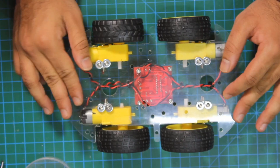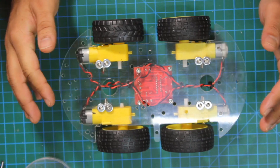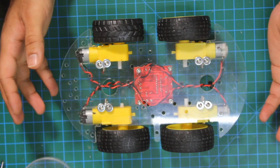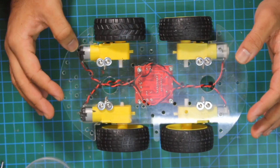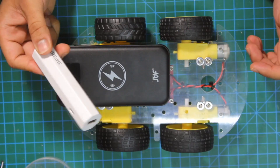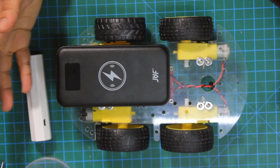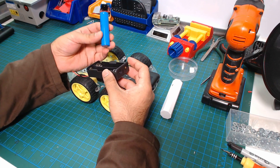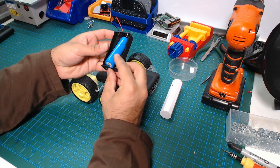The next step is to add our power supply. When working with Raspberry Pi, power supply is a bit tricky because your motors work at 12 volts or 7 to 8 volts, while your Raspberry Pi works at 5 volts. The Pi needs a lot of current, and the motors need current as well. So it is often convenient to have two separate power supplies. In our case, we have a few power banks — we can use one to supply 5 volts to the Raspberry Pi for a consistent, high-current supply. For the motors, we have cheap batteries that run at 3.6 to 3.7 volts each, giving an output of about 7.4 to 7.6 volts combined.